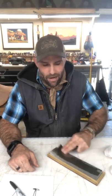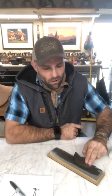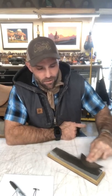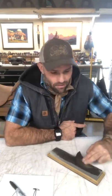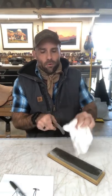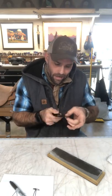For my less delicate knives, my modern made everyday working knives, I have a two by 72 slack belt grinder and I do all my quick sharpening on that between the grinder and the buffer. You can get a just hideously sharp edge in two minutes, and two minutes is vastly superior to spending 15 or 20 minutes doing this by hand. I have to sharpen several times a week, sometimes several times a day, depending on what I'm working on. That's not due to the inadequacy of the tools — that's simply the nature of the job.